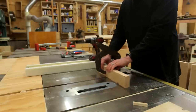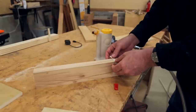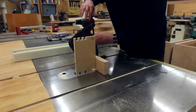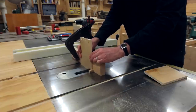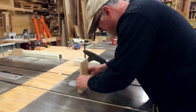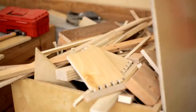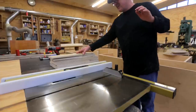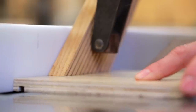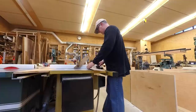When I was cutting these I was thinking I'd make box joints to hold the drawers together — with box joints the lengths of each piece could just be the length the drawer needs to be, since the joint doesn't take up extra width. But after making a little jig and doing some practicing, it really looked like it was going to take too long cutting all those little pieces. It was going to be hard to keep them accurate with a simple jig — I'd really need to build a full sled to do it right, and I didn't have time for that.